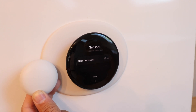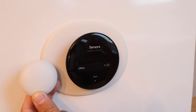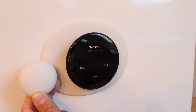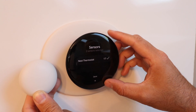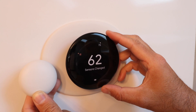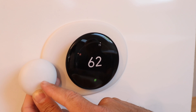Click on Sensors and we'll make a selection. We've got both of our sensors here — the Nest Thermostat currently at 68 degrees and the Nest Temperature Sensor in the Office at 73 degrees. If you click on both, it will try to average out the temperature between them. If you select only the Nest Thermostat, it holds that temperature; if you select only the Office sensor, it holds that room's temperature. We click Done and it now reads 73 degrees — the Nest Temperature Sensor Gen 2 current temperature reading.